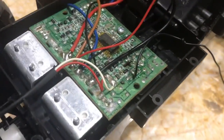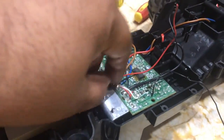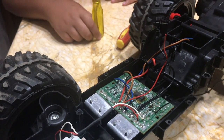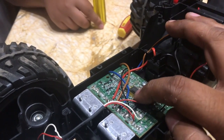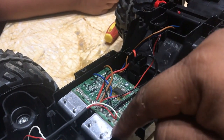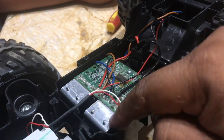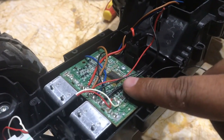Looking at the existing electronics, the front DC motor is connected to this circuit which also has an antenna. What this circuit currently does is receive the radio frequency signal from the remote. There is an integrated circuit here that understands the radio signal and sends instructions to four transistors. These four transistors together form a dual H-bridge circuit which is used to drive the two motors — one at the back and one at the front.